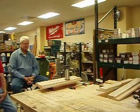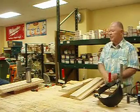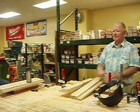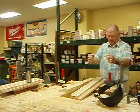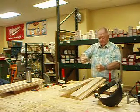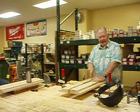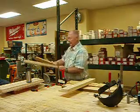And unless you make a terrible mistake, like I did one time and used a clamp that wasn't the best clamp in the world. I was making a bookcase for this lady, and I glued up the panels like Jay's talking about. I forget the wood now, but it wasn't cheap. And I'm going along there, the last dado. Oop! 90-degree turn. What? The clamp slipped. I can't overemphasize, clamp it tight. Get it as tight as you can get it, and then 3 more turns.